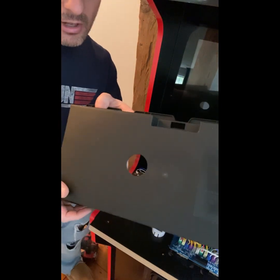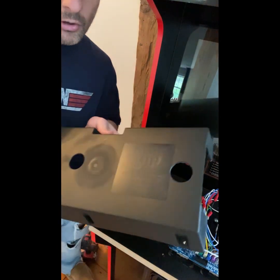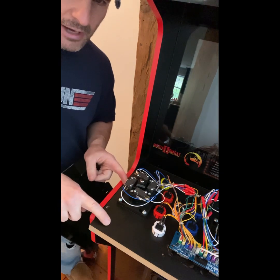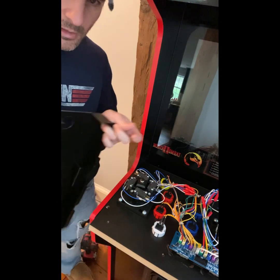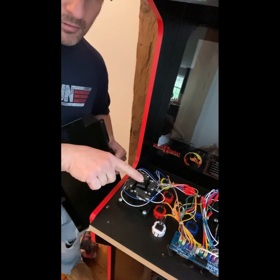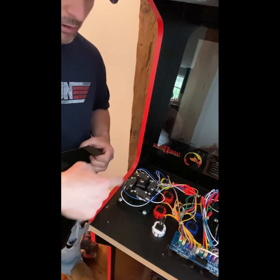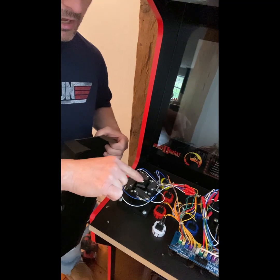And then for the holes, instead of just carving it up and trying to router, this is actually an inch and a quarter hole that I used with either a spade bit or a hole saw, and just did a measurement from a point. I actually did it from the center of this little mounting hole for your deck protector, or this dust guard, to about the center of this, and ballparked it. This happens to be 3 3/4, this measurement. And then basically I just came from the outside wall of my dust cover to the center of this, and that X marks the spot.